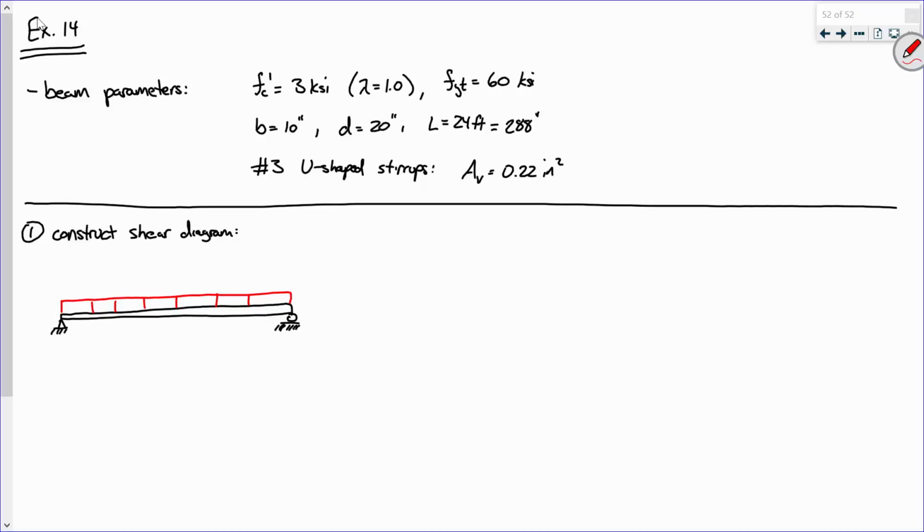All right. The distributed load in this is what, 4 kips per foot? Okay, now we've got 2 point loads, which are about right here and right here. And what are those point loads? So help me out. Does anybody know how we can compute the reactions? Well, we can sum moments, but can we just keep this simple? It's half and half, right?